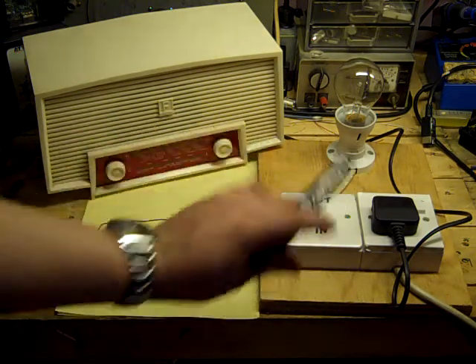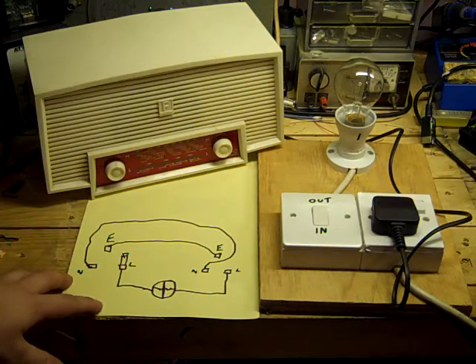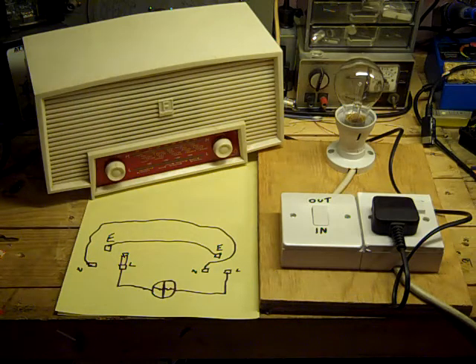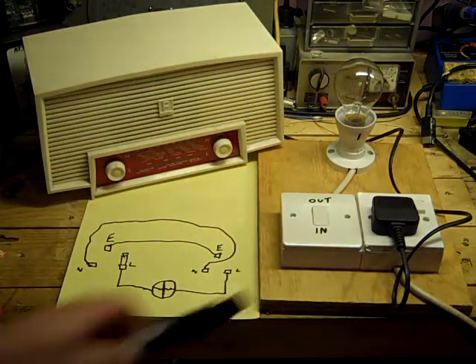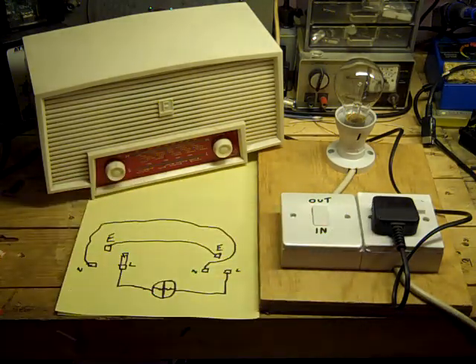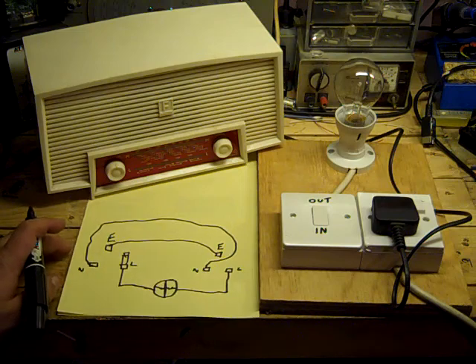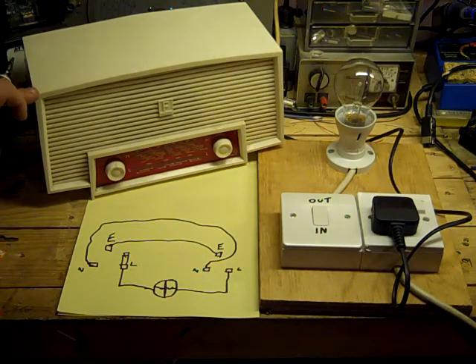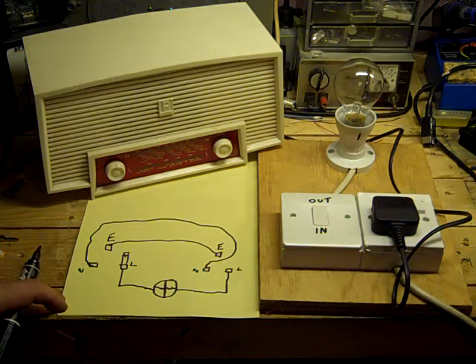The only difference between the simplest version of that circuit and what I have here is I've added a switch, because I do this a lot. If you're just beginning with this, just stick with the simple circuit — you don't even need the switch. You could knock this up for about a tenner from somewhere like B&Q using secondhand parts. All you need is a single socket with a switch on it and a lamp holder. I highly recommend building something like this for your own peace of mind and safety if you're into this old vintage valve stuff.